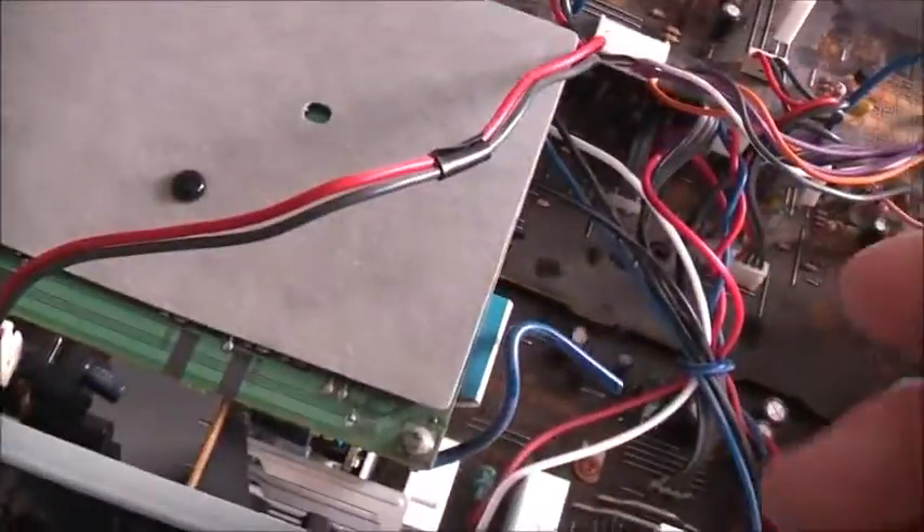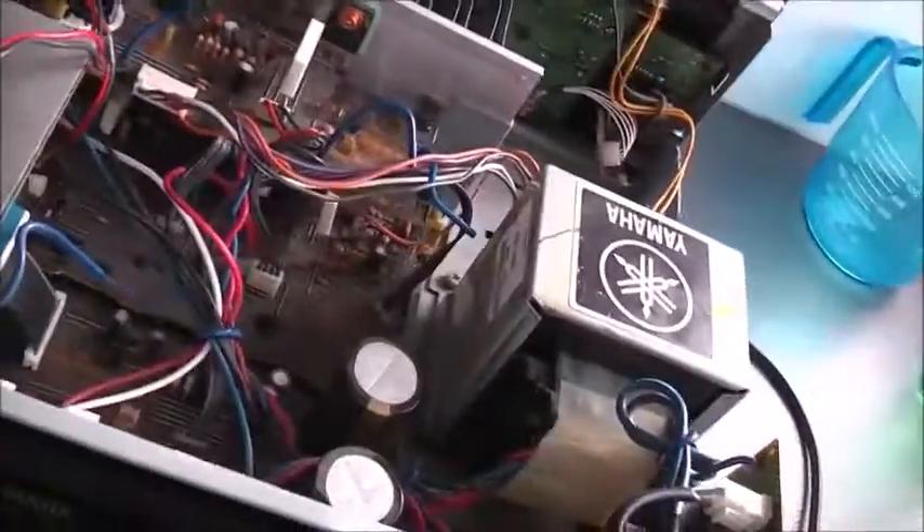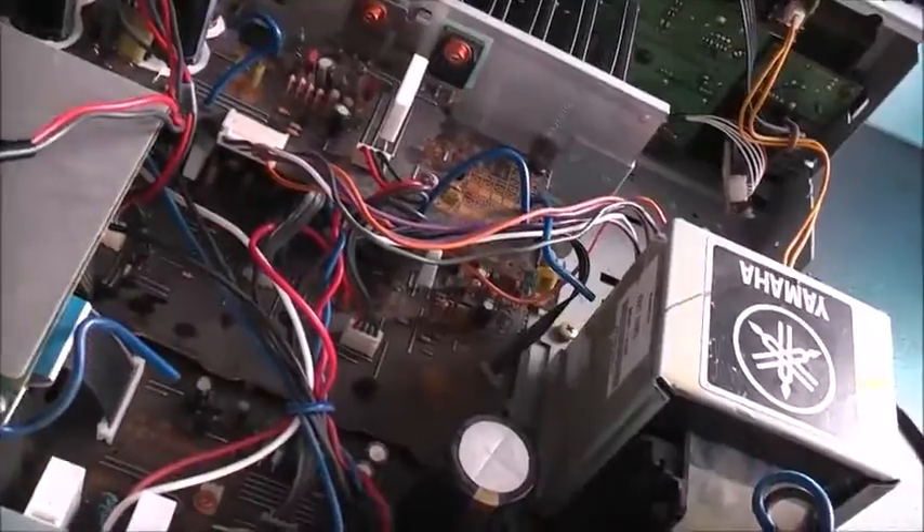G'day. The farthest I've got with this thing — I've changed this transistor which got hot, and that seemed to have not really made a difference. So I've disconnected this board completely and I'm still getting a short. Power is on, power is off straight away. It doesn't let me turn the speaker relays on.